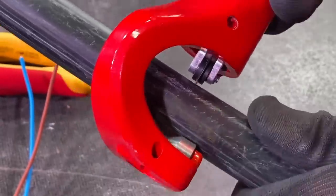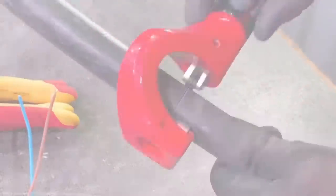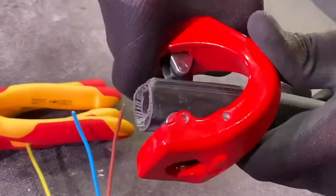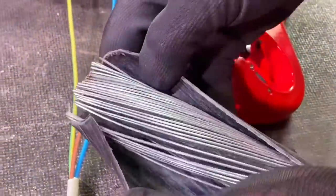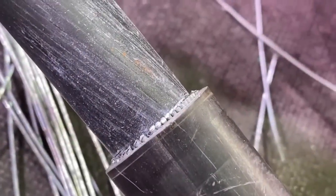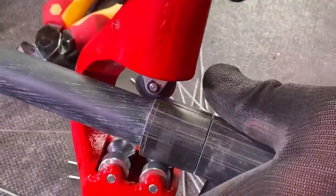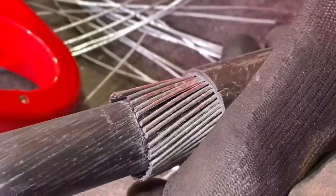So you're back in for another attempt at the 5-core 16mm² one. I just thought I'd try and go a bit deeper this time in terms of the cutting. You can see they're deeper there. It'll be interesting to get feedback from anyone using this tool as to how they judge exactly how far into the cable to go. A lot of them have broke off — that's a lot easier. You can just gently scuff the bedding material there. We haven't gone through it, so that's probably exactly right. There's that last bit that causes all the trouble. You probably just went a touch too deep and went all the way through the cores — and you can feel when it goes through the cores.